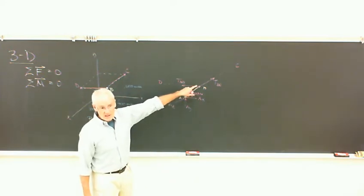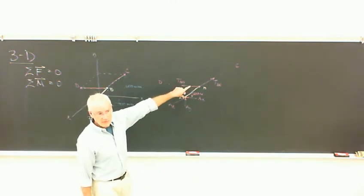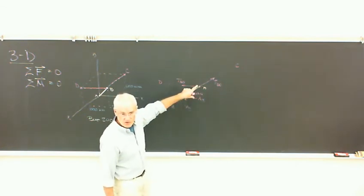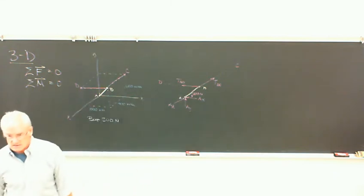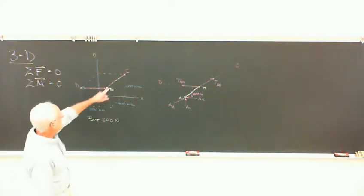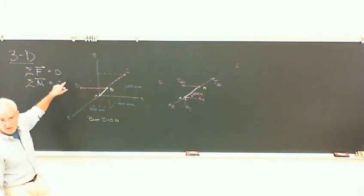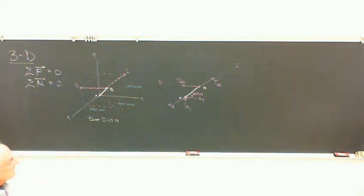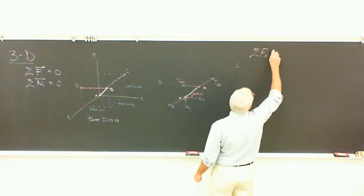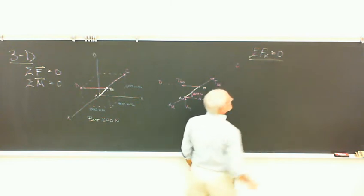Yeah, remember, this is a free body diagram, free of other things, like the wall. So it's only forces on the object as the subject of the free body diagram itself, which is the bar. There are other forces in the problem, of course, and as a designer, you might be just as concerned with how to attach it to the wall. But for this part of the problem, all we're looking for is the tension in the cables and the two reaction forces.